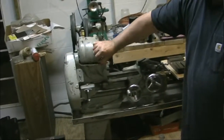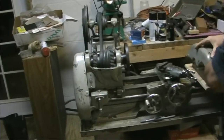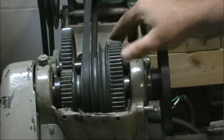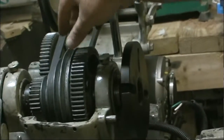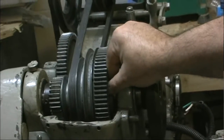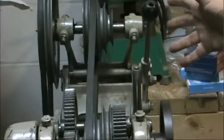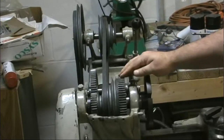The reversing, I'm sorry, I forgot I had bolted that. The back gears, where when they would launch or engage, there's a pin here that has to be pulled, so that allows the bull gear and the pulley to freely spin. And this is seized in here, so I think in order to fix that, I'm probably going to have to pull the spindle. Now things here are not really bolted up; they're just kind of together. But we're going to talk more about this lathe.